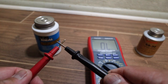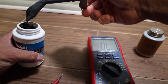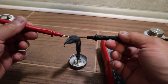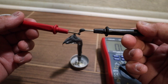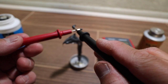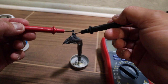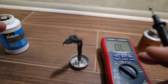Now this is the Noalox. Let's open this up. This is black and gooey. We're going to test and see if it conducts. Nothing. But when the two metal probes touch each other — yes. So with the grease itself, it doesn't conduct. Neither Noalox nor JetLube conduct electricity by themselves.